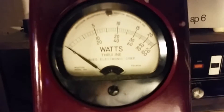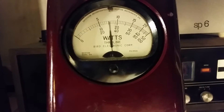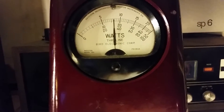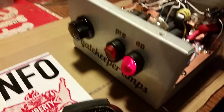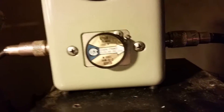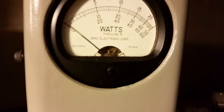We're gonna be putting about four watts RMS drive — let me show that to you real quick. It's actually a little bit under four, so we're putting about three to three-and-a-half watts RMS into it, which is about 18 to 20 PEP. We're on the thousand-watt slug as usual, and variable is all the way up. Right there, about 180 to 190.